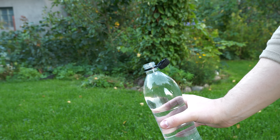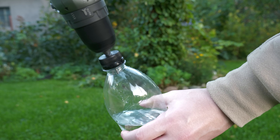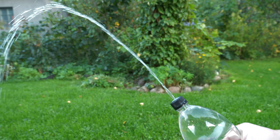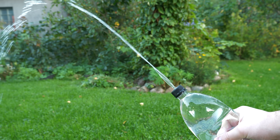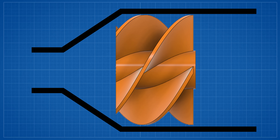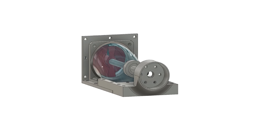If we take a plastic bottle without a cork and squeeze it, the water will rush out. But if we add the cork and drill a 4mm hole, the water will also rush out from the bottle. That stream of water is what we want from the waterjet. If we add an impeller inside the pipe, now something actually moves the water from inlet to outlet — and this is already a waterjet. The real example looks a bit different, but the working principle is exactly the same.